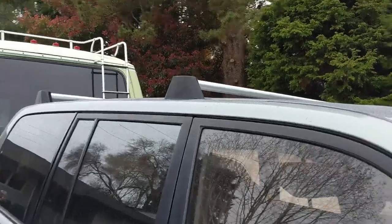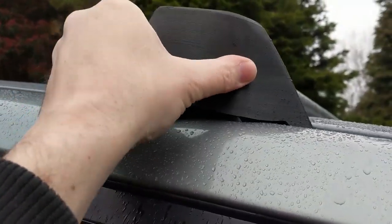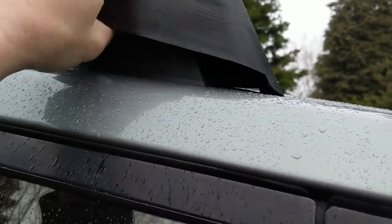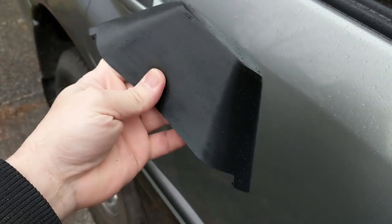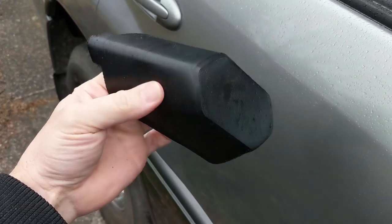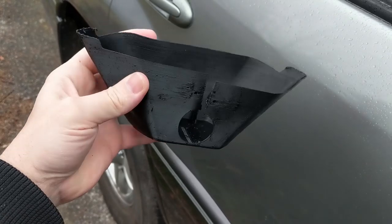These covers look pretty good, but this first iteration is kind of flimsy — it just flexes a lot. Plus there were printing problems: it was too thin and just flexed as the print head moved about on it, creating mistakes. I have to redesign this thing for printability and to be less flimsy.